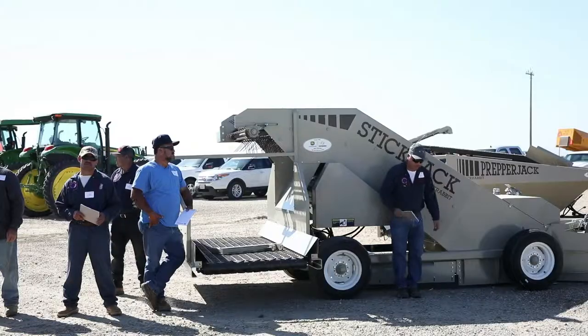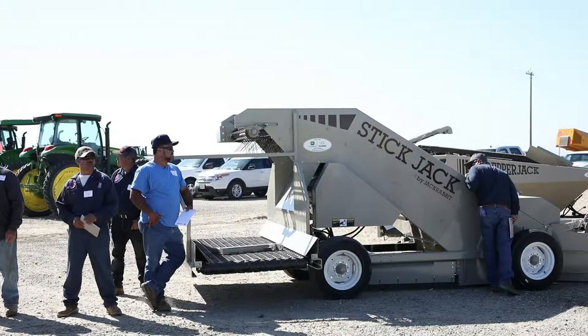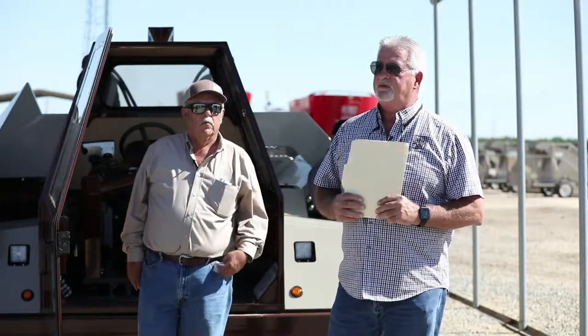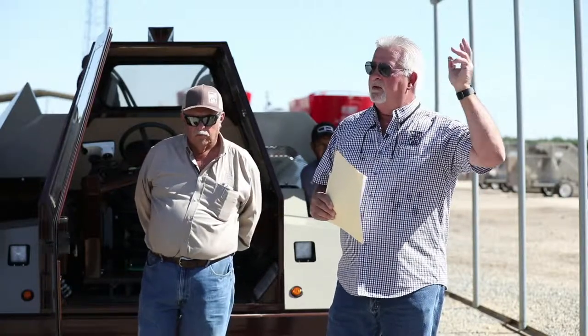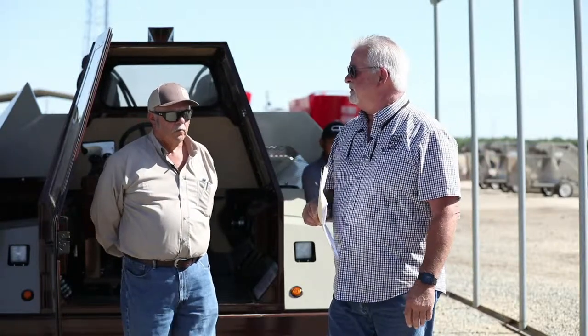Any time it's moving, a basic rule of thumb for any of this stuff, if you've got augers going in the wedge cart, or the stick box belt moving, stay away from it. You'll get in trouble trying to fix something while it's moving. The good rule is to make sure that the tractor or the harvester is shut down and the driver is out of the seat before you make any repairs or any adjustments. Okay?